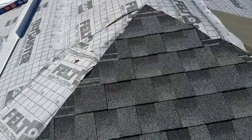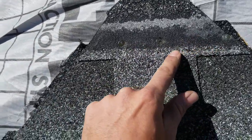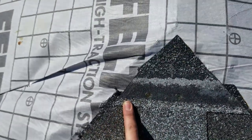All right, you guys are about to see an epic battle. For anybody new to this channel, though, I want to explain something to you guys before we get started. So these shingles, these Timberline HDZs, you don't have to nail on this line here where that common bond is.